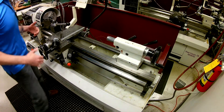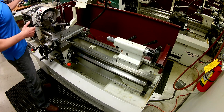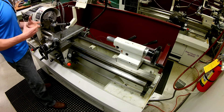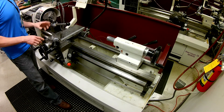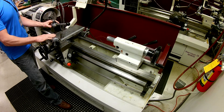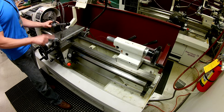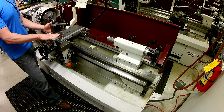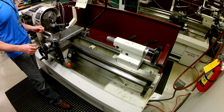In this section we're going to talk briefly about doing the lathe setup. We've already got power on to our DRO. In the shop manual you'll notice that this compound right here should be set at 37 degrees — it is set at 37 degrees. Once you've had this compound flush with the end, and likewise over here it's flush, that's where it's to be left.